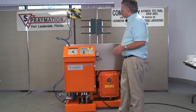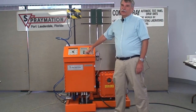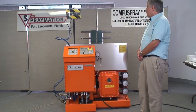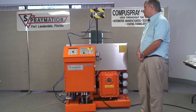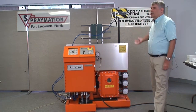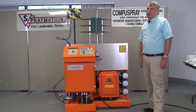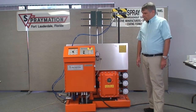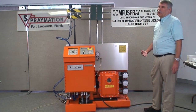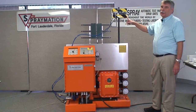Once we've confirmed everything is ready, we pull out the emergency stop. It applies power to the motors, the spray guns, everything — anything can move now. We push start to begin the cycle. The green cycle active light begins to blink, showing the machine is actually painting a cycle. The index resets itself, the horizontal resets itself and does a speed check. Once it gets home, it will do the first painting stroke. Between painting strokes, the vertical index moves so the painting strokes will overlap. This particular painting sequence has a short dwell time at the end of each stroke.